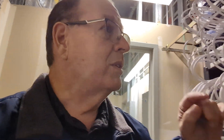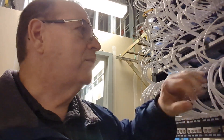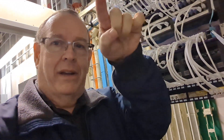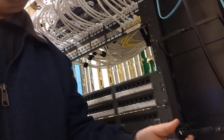Another one of my big problems with fiber — and these are all self-inflicted — is that my boss, I love her, she's a wonderful person, she likes things neat and tidy. So when she does cabling she'll bend that fiber over, put Velcro around it, and make everything look neat and tidy. But fiber doesn't like tight radius bends — it just doesn't. There are some places where she's wrapped the fiber down and around and bundled them all together because the fiber was too long. That was done here as well, and you can see all the Velcro I've taken off to get rid of those tight radiuses.